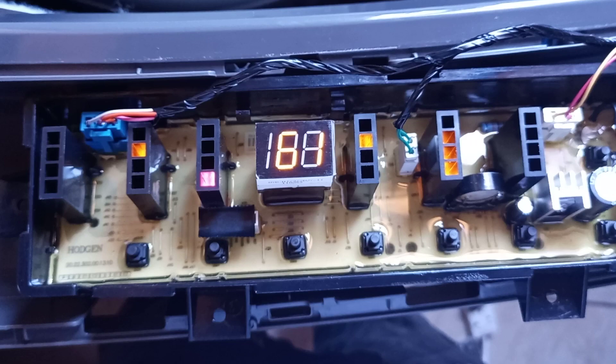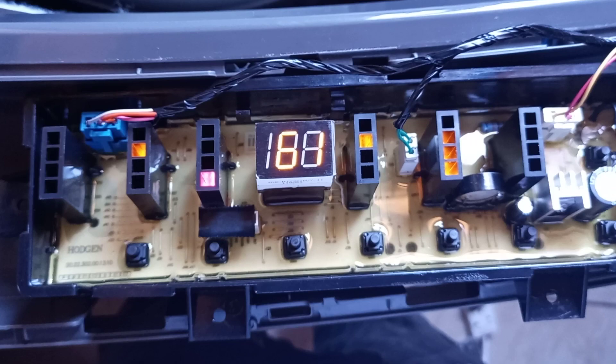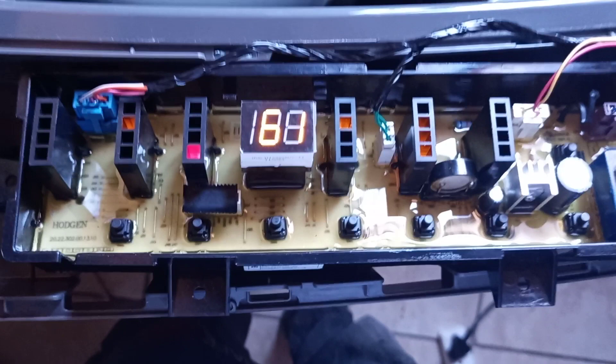While I was at home, the machine was showing E5 — that error has to do with the pressure switch. But I know it was just because I had taken the board home without the rest of the machine, so the pressure switch was not connected. Thank you.